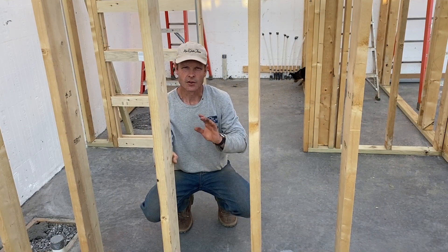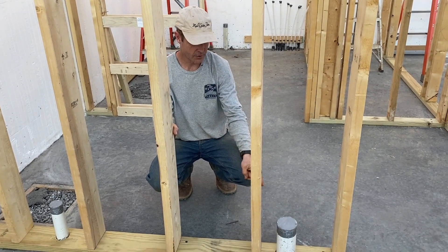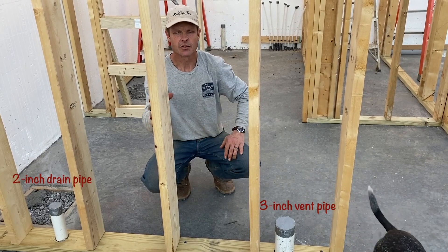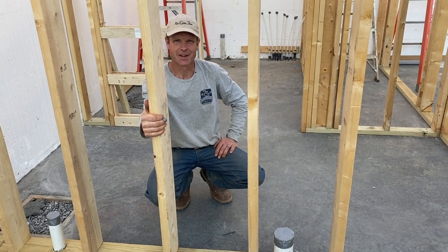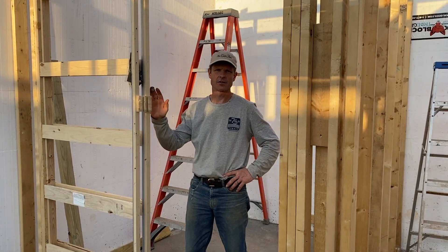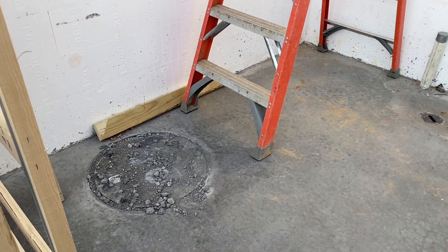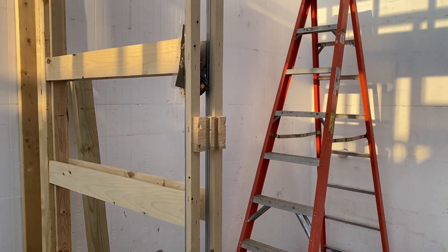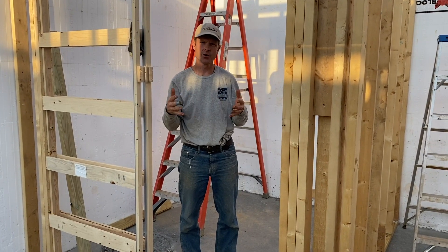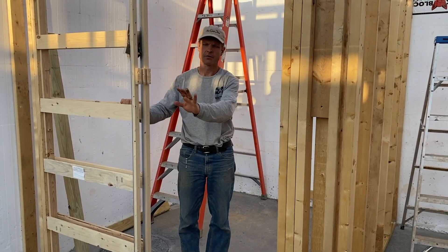There's one wall down here in the basement that's slightly different — it's a two-by-six wall. The reason they did that was to allow for the venting: there's a three-inch vent and a two-inch there. You don't want to put a three-inch vent through a three-and-a-half-inch two-by-four wall, so they use a two-by-six. This is in the bathroom area. There's also a pocket door here because standing in the utility room, there's the ejection pit and all the floor heating for the hydronic system. We can't really swing a door into the bathroom — there's not a lot of room — so there's a nice pocket door to close off the utility room from that portion of the bathroom.